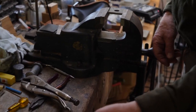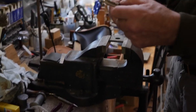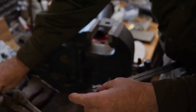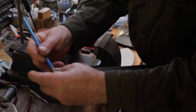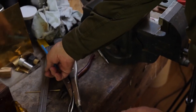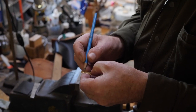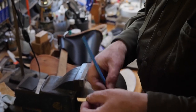So, right, I need to make a hole. I think I'll just use an eighth of an inch. So you would put the holes in before you bend it rather than afterwards? Yes. My hole punch won't do it after the bend. It just won't fit. You can't get it in. I've got to mark these in the centre. That's the only tricky bit really, getting them reasonably central.